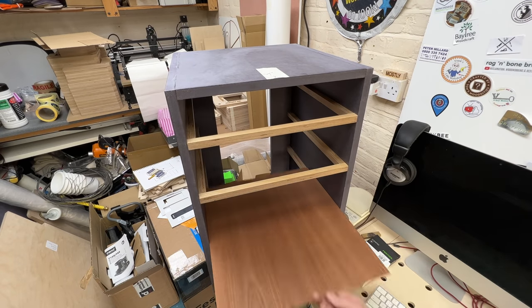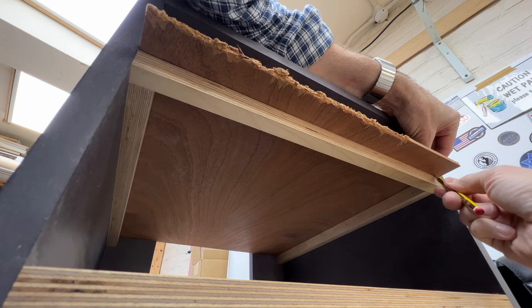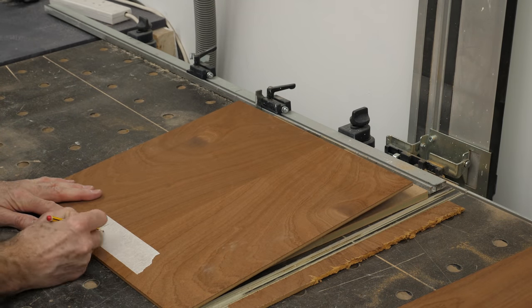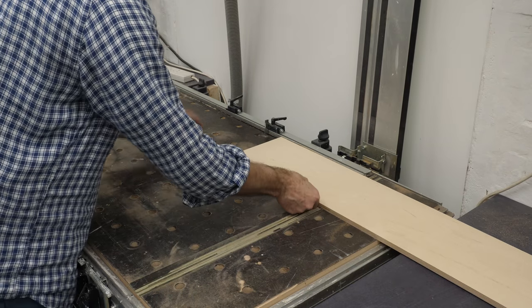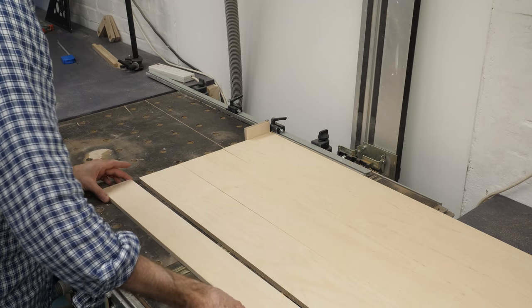With all the strips complete, I've cut a template from some scrap to make a nice snug fit in the carcass, and once checked, I can cut this to length as my definitive guide. All measurements are now taken off this guide using an appropriate packer against the flip stop, 12mm here, to set the cut, and cutting all sizes of the drawer at once on the MFT.